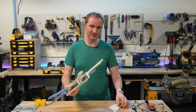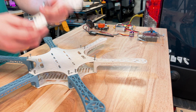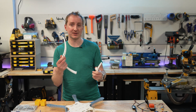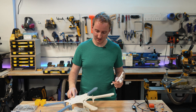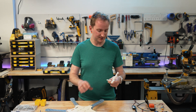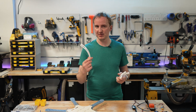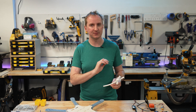I've also got some landing legs, which I do find important. These legs are the same kind of design made out of plastic, but they are not made out of nylon. All of the frame is nylon with glass fiber, the strongest filament from the previous video. The legs don't need to be strong — they're just landing legs, not taking huge torsional forces. These are just PETG because it prints nicer, and the nylon filament is very expensive.